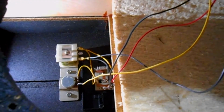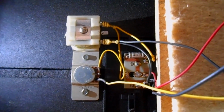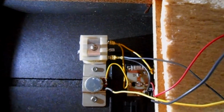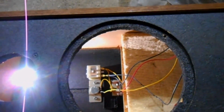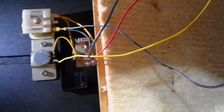So this is the inside of the speaker. That is the 1980s crossover, which divides the frequencies for the different speakers that the system consists of, such as the larger speaker known as the woofer, and then in this area the smaller speaker known as the tweeter, and sometimes you can have a mid-range speaker, which is usually a three-way speaker. So there are three basic components of the speaker. This one only has two. There's acoustic padding in there from 1980, and also you'll see that there's a sort of a shelf in here, and I'll show you.